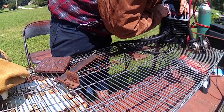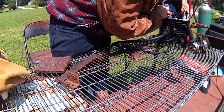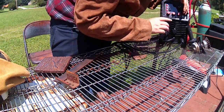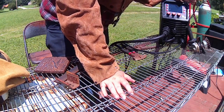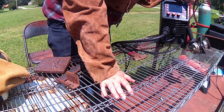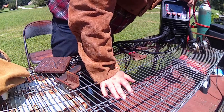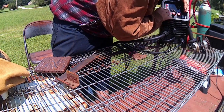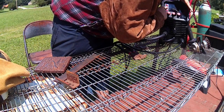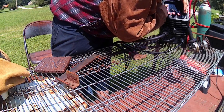Alright, so here we got our mode. This is our stick, TIG, aluminum spool gun, MIG, regular MIG. So we're using 0.030 solid wire, ER70S-6. So the metric drive roller for that would be the 0.8. So we'll do that. We'll go back there. We'll set mode MIG. Okay.